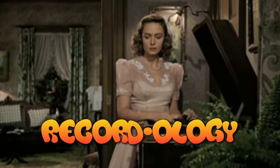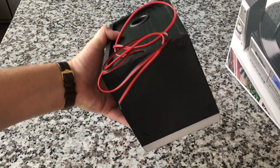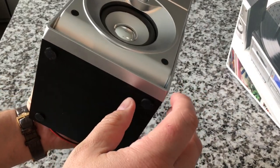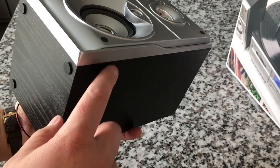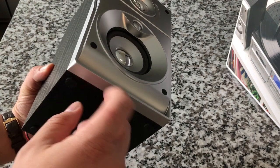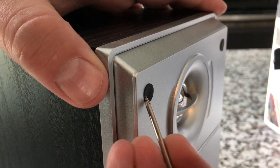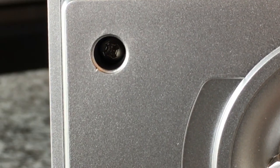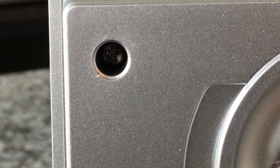Welcome to Recordology. So unfortunately there are no screw holes on the back. I think these are just pads — I don't think they're hiding anything there. But I'm more inclined to think that these pads are hiding screws for the face plate that attach down into the speaker cabinet. So I'm going to gently pry this foam pad up here and see if there's a screw under there. And that would be affirmative — there is a Phillips screw in there.